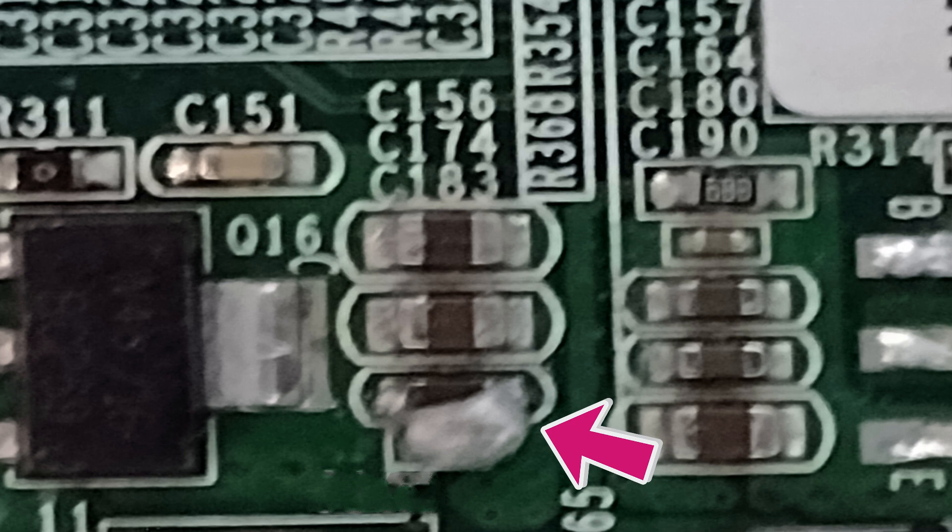You'll definitely see some resistance on the pads if you're further than that small distance apart. I'll set my meter to the 200 millivolt scale, and then multiply the reading by 10 to get milliohms — because we're measuring the voltage drop across the resistance of that short. That follows simple Ohm's law.